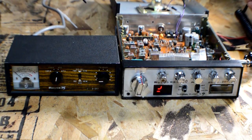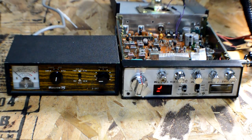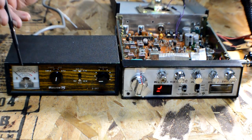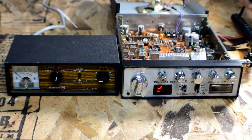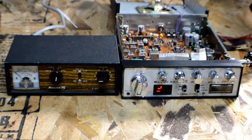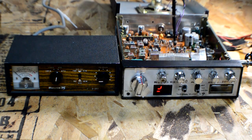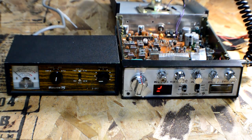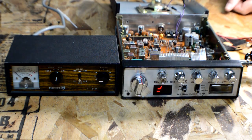The next thing we're going to set is the modulation. We turn that switch right there over to modulation. I'm going to key this up and whistle into it a little bit — you can watch the needle move up. You can see our modulation is not very good. So what we're going to do is turn VR5 — that's our modulation set. We're going to turn that up and then try it again and see if our modulation got any better. And we've got modulation up to about 80%. We want to leave it about there on this radio.